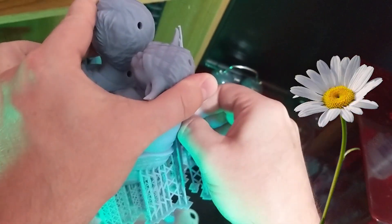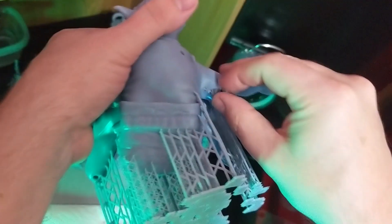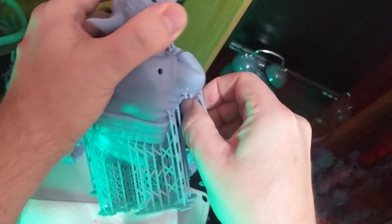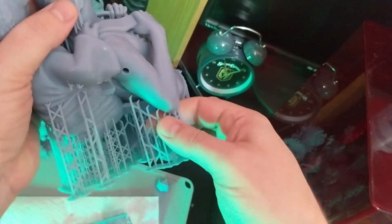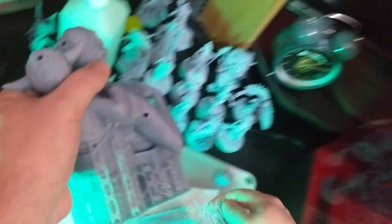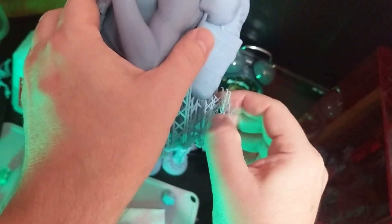You can see the little R-shaped supports I do, which aren't always necessary — it's a little overboard sometimes. Now look at his arm: those single ones are going to come off. Oh yeah, they're already coming off. They just fall right off. So this whole doing the fan supports thing — not always necessary. Look how thin these ones came out. These are the fine supports, the light ones. They give it a little added support, but they just peel right away, which is very nice.